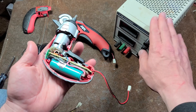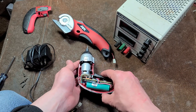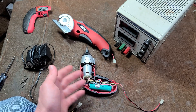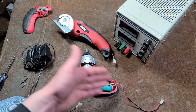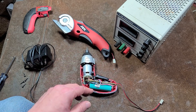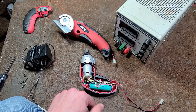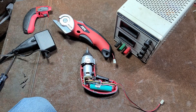I hooked up a couple of wires to a bench power supply. Seeing that it had a lithium-ion cell, I knew that those operate at 3.6 volts, and the average charge voltage is 4.2 volts. The charge board is going to drop some voltage as well, because it uses some electricity just to run the charging circuitry. So that allowed me to say: it has one battery, so it's going to need a minimum of about 5 volts to be able to charge this.